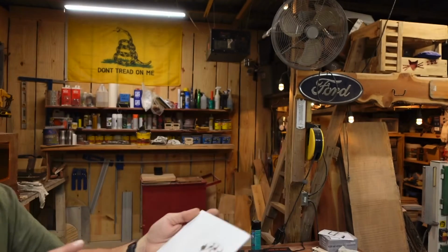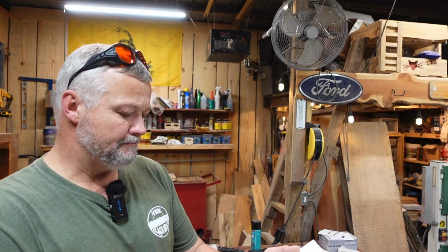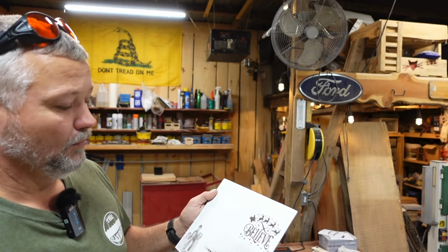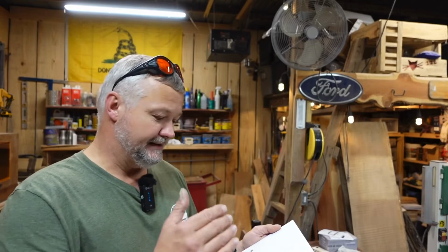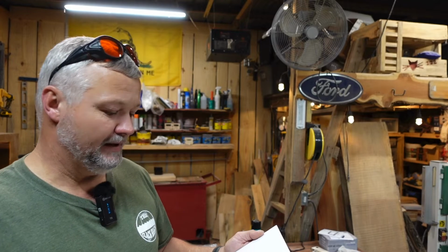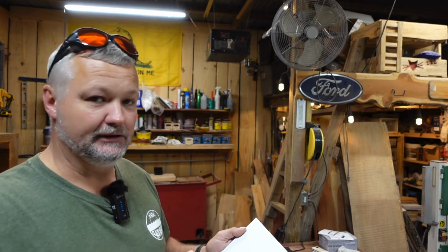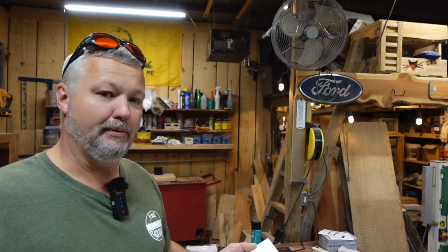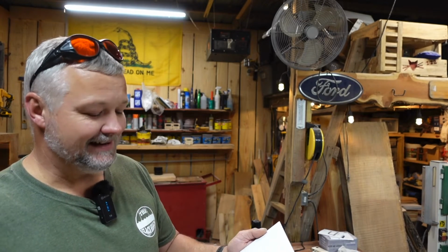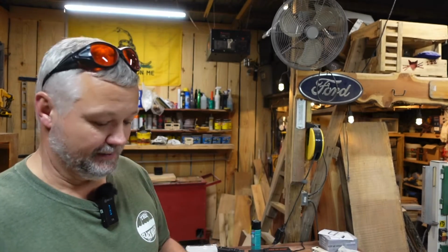Of course, on my finished product, I plan to turn the DPI up just a little more on this, but the settings that I ran for the engrave were actually pretty good. I probably could have stood to come on up to, let's say, 60 speed at 100 millimeters per second at 100% output, but I kind of like the little bit of discoloration in the background of the image. It makes it look not printed, as opposed to just looking like something that was printed on here. You can tell that it was actually engraved. So I kind of like that. Nothing came through the back, so I didn't go too crazy with the power settings.